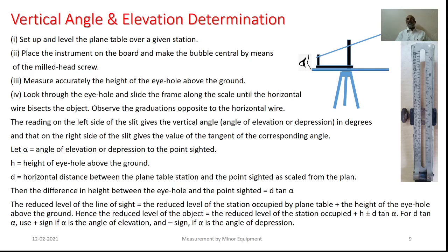Also, as we have the line of sight horizontal, we can have the elevation of that particular peephole measured with respect to the ground, and we can define that as EHI. Having known the EHI and the vertical angle referred to the object under consideration as well as the distance measured between the instrument station and the object, we can determine V, which is nothing but D tan θ, where θ is the vertical angle. As such, EHI ± V, that is D tan θ, will give us the elevation of the object under consideration.